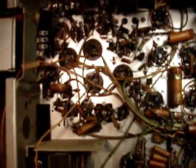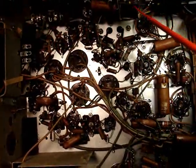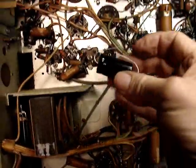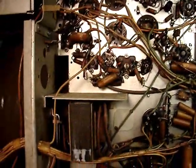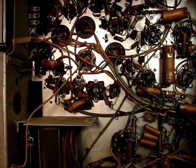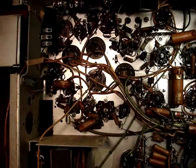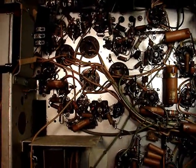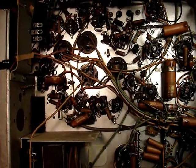This thing is really crowded, but the hardest part is going to be these electrolytics up here — these four cans plus the two up here. I have electrolytics for those, but I'm going to have to put them in strategic places. For example, there's a 72-microfarad electrolytic, and I don't know why they came up with 72, but I'm going to put a 40 and a 33 in parallel to come up with close to that value.